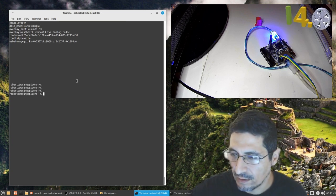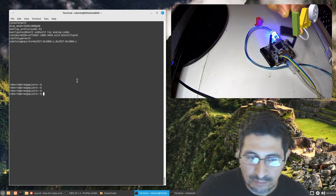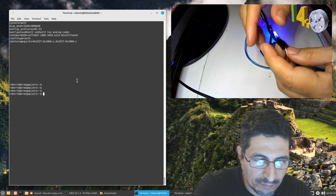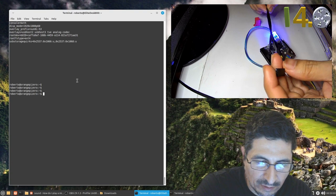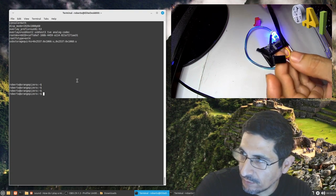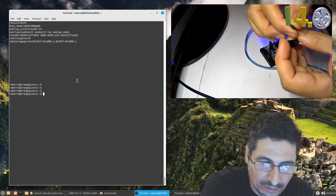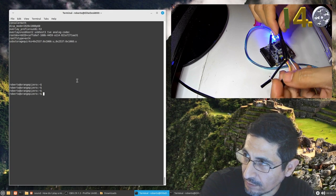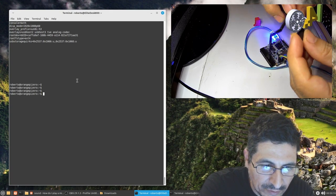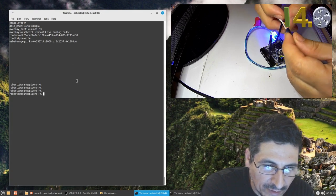And now I have this cable which I made. It's made from a yellow, red, and white audio video cable, and this is for the ground. All the ground lines have been joined together. The yellow is for video, the white is for left, and the red one is for right side audio.